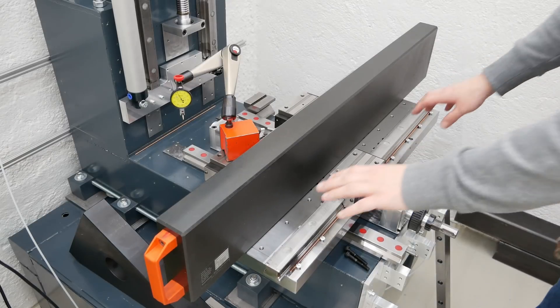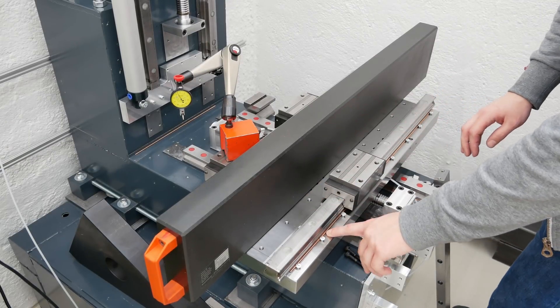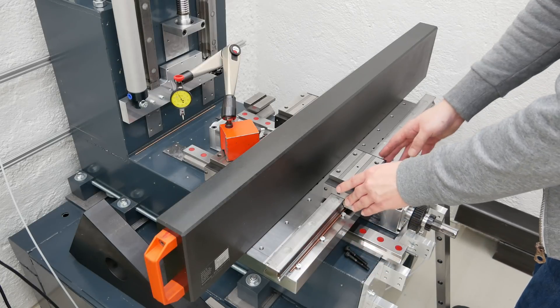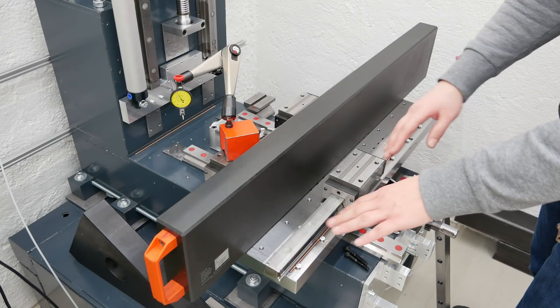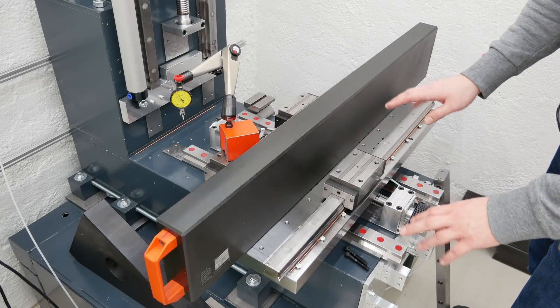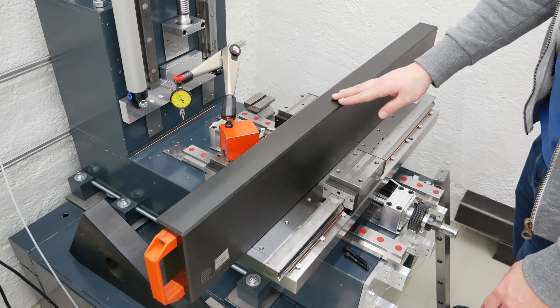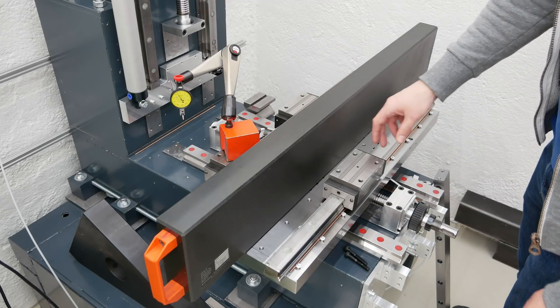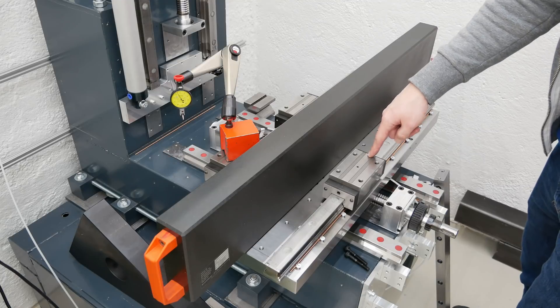The rails are mounted now and the method with the rod and the counter flathead screws worked pretty good. It was quite easy to align, and in this direction I got it to about two micrometers against the straight edge here. The second side was also fine to align and I aligned it to the first side, so the rails are parallel.